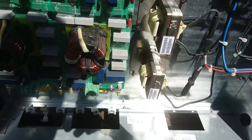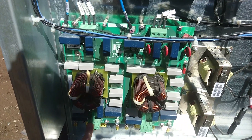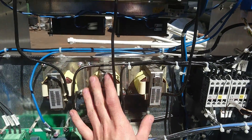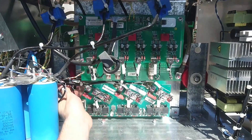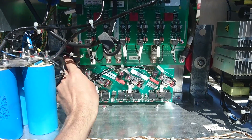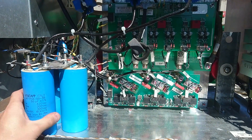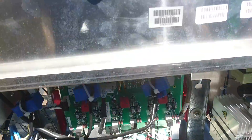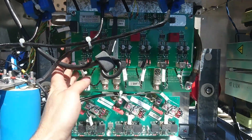If we go back and look at where the main supply comes in, this is the right board here and we have the load connector over here. So basically this input and output filter board connects up through the bypass chokes and power relays to shift between modes. The wires going through here come from the input filter side, go to the active rectifier board, go back through the power relays on the other side, come back to the three-phase rectified capacitor filter, go up through these three current transformers, come up to the intermediate chokes, and go back down to the inverter board.